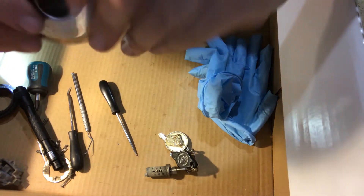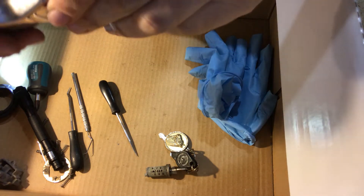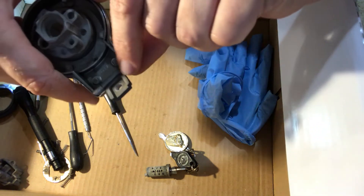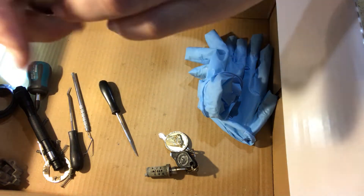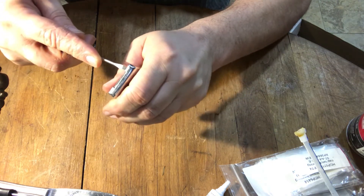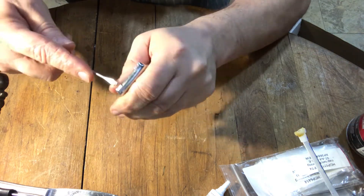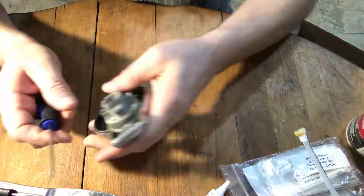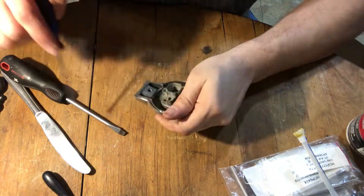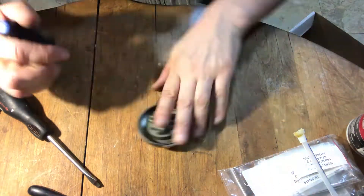There's also another O-ring underneath the chrome. So to get to it, I have to pull the chrome off — that's going to be fun. I believe there are a couple of little spots here where it's crimped. I start working with a small blade on the crimp marks, then slowly working my way around, progressively getting to a larger screwdriver, and eventually using the knife to kind of hold things in place. And it finally comes up — patience is key.